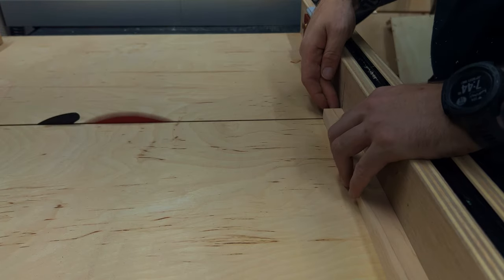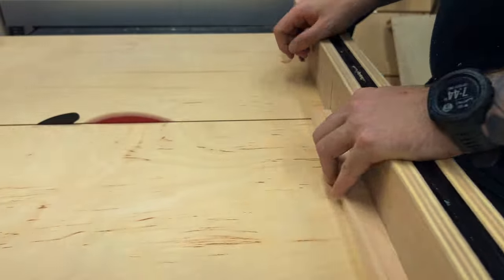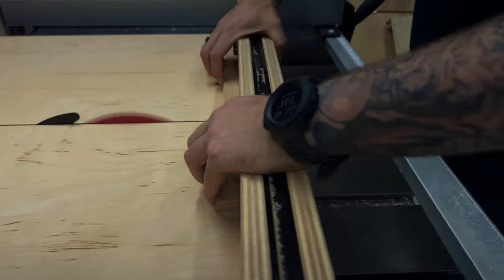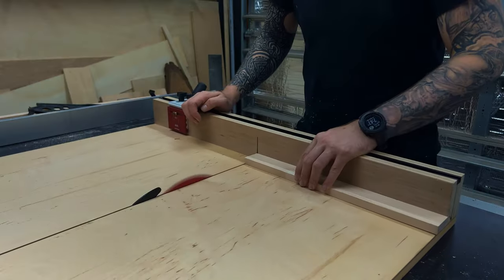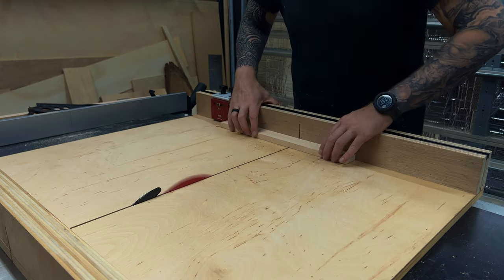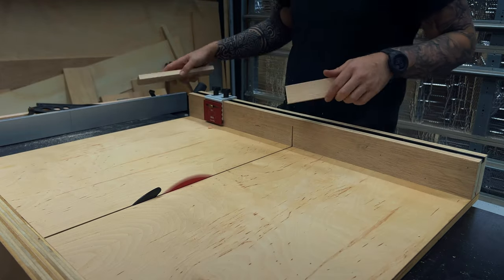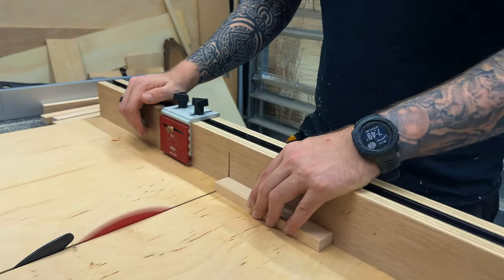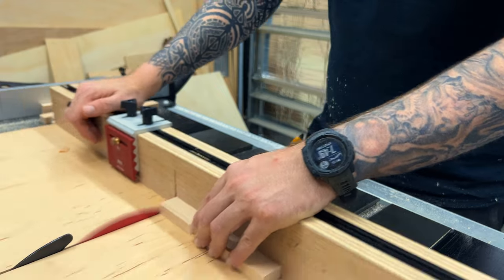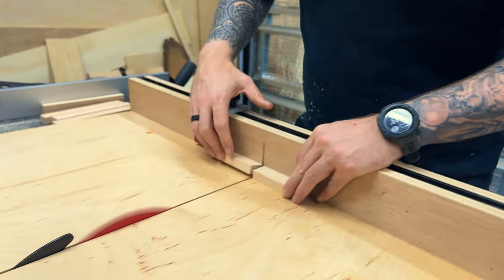With all the side pieces routed out, all that's left for the sliding arms and the side baskets is the cross pieces that hold them together. Everything is 1 inch wide, except for the very front of the arms. It's also cut a little long for what will eventually be dovetails. It's the same idea as a drawer. If you're constantly pulling on something, you want it to withstand that force, well, like forever.